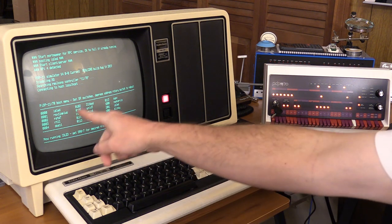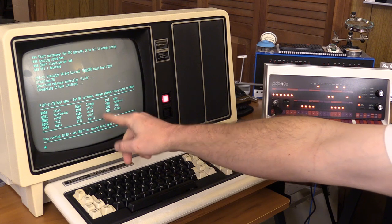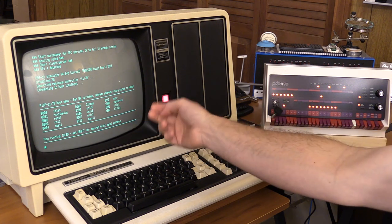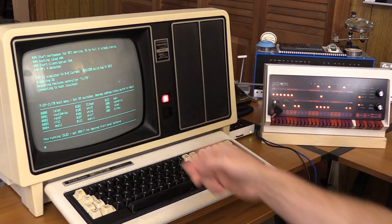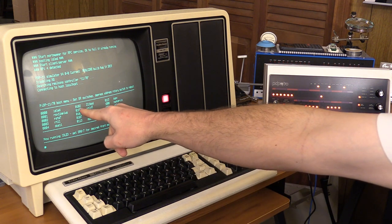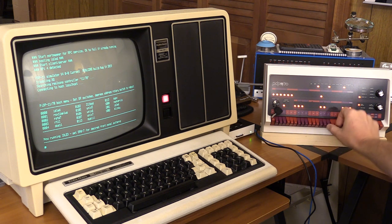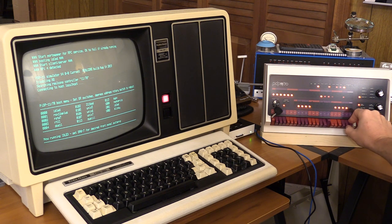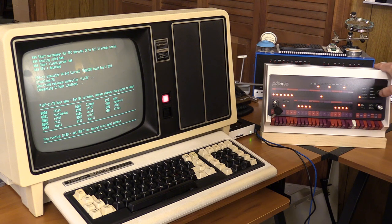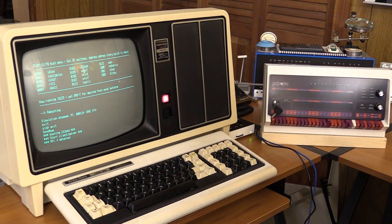So there's a bunch of operating systems on here, and many are a derivation of Unix: 2.11 BSD, Unix 5, Unix 6, Unix 7, Unix System 3, and Unix System 5. Either way, let's do BSD first. So it's 0102, which means these four switches will control that. And then we push the little top address knob here, and it will reboot straight into the SIM.